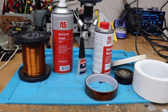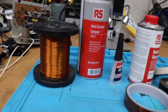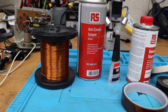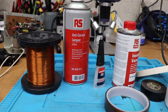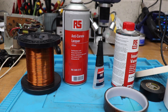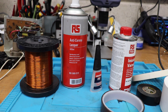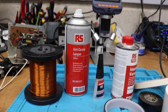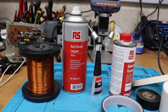In terms of materials you need for winding up a LOPTY, you're obviously going to need wire - quite a bit of it - and you want roughly the right thickness as per the windings you're trying to wind. I chose polyester-coated wire, which you need to scrape off with a knife. If you look at enameled wire, there's a very good website called wires.co.uk which sells all sorts of different types of enameled wire. They sell polyurethane-coated wire which you can solder off, but I went with polyester-coated wire which I think is probably a bit more resilient.